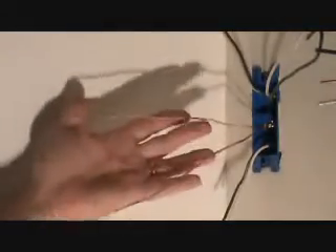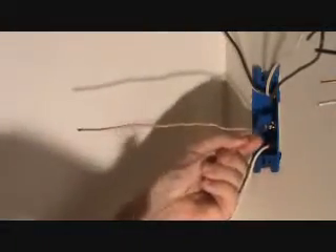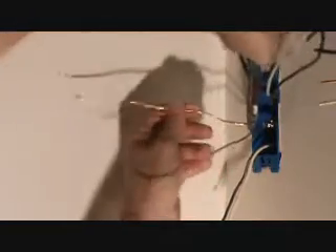Could you do it without the caps? I wouldn't advise it. I've seen it done without the caps — if you keep twisting it with the pliers it probably will work, but I like the insurance. Does it matter which wire I cut off? Not really, but I still like to work with the longest one for later. Plus, this one is at the top and I want to fold it up to the top. If I cut the bottom one, I've got to fold that down, and it's easier to reach up at the top.